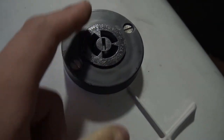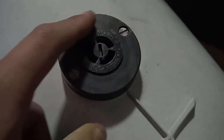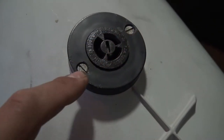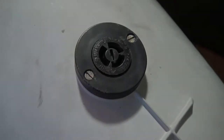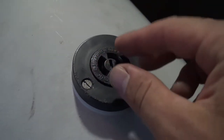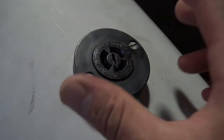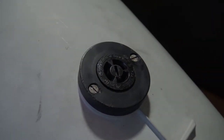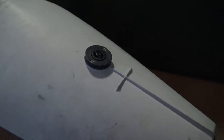Here is the photocell socket. To adjust it for your photocell position, all you've got to do is undo this ring by loosening these two screws. This ring is really just pressing down on this piece. Once you loosen those, this piece will spin. Once you have it spun into the spot you want, all you've got to do is screw those back down and it holds it right in place. Pretty straightforward — nothing else to it.